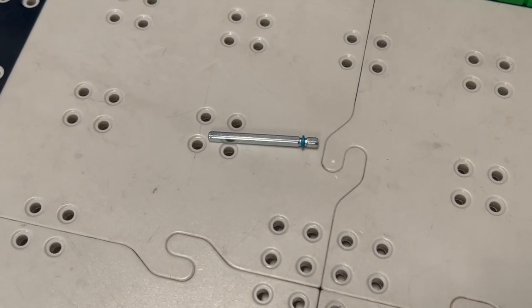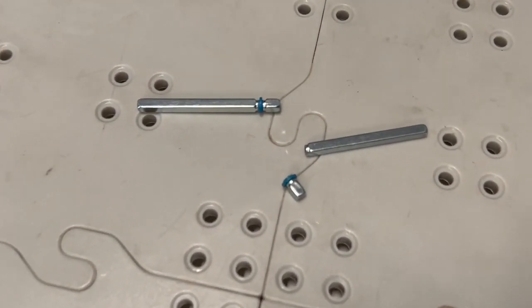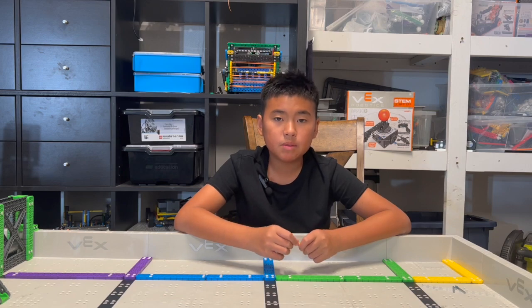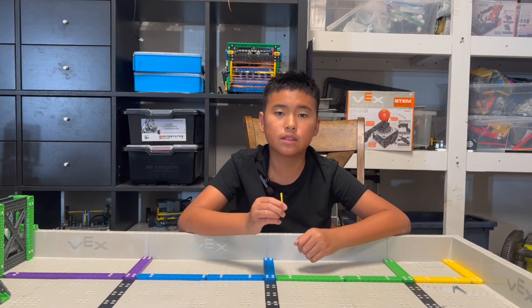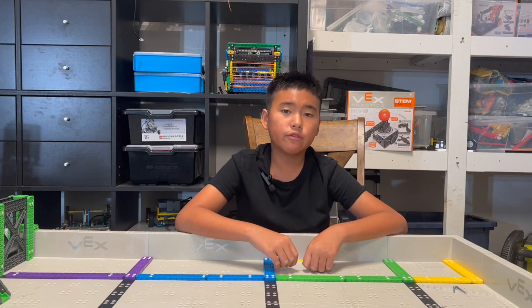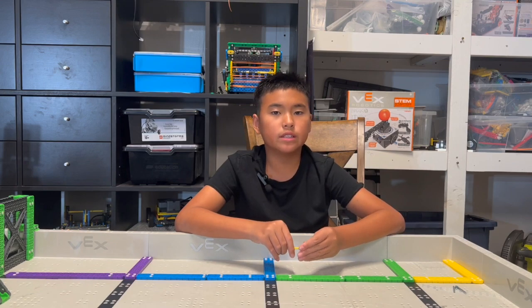This is a good metal motor shaft, but this is what happened. Previously, we had problems with the plastic shaft — the plastic shaft would twist easily when connected to the motor — but we thought the metal shaft would last forever. Not in this case.